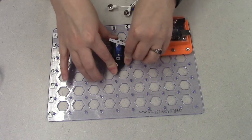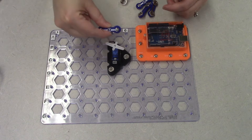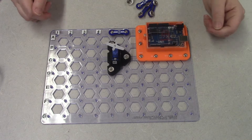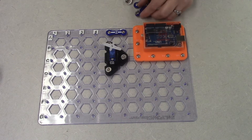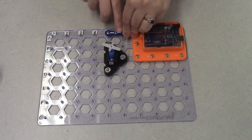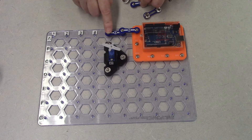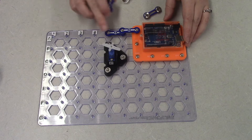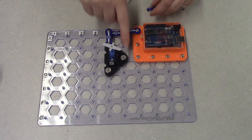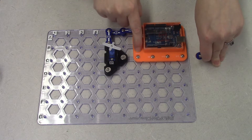We have our servo set up and now we're going to put a two-snap along A5 to A6. Then we complete the circuit: starting with the 5V, we connect A7 to A6, then continue to connect to the positive connection on our servo at A5 to B5 — snap that right on top for positive power. Then we ground the servo by jumping from C6 to C7 to the GND on the snap Pino unit.